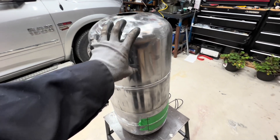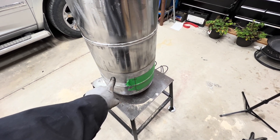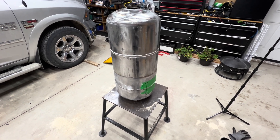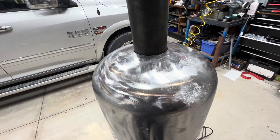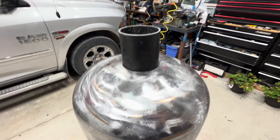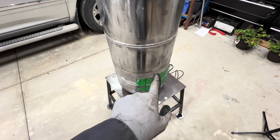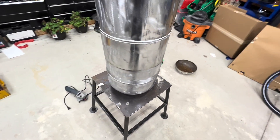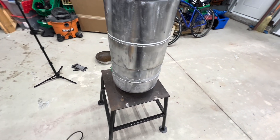With that flue coming out from that hole and welded tightly around there, this other part of the tank is going to sit on top of that 20-pound tank and will be the water heating vessel. The flue running through the domed part of the combustion chamber is really going to act as a miniature water heater — very similar construction to what you'd see in a residential water heater, just scaled down considerably. The flue will stick out the top and be welded watertight on the inside, and where the 30-pound tank meets the 20-pound tank will also have to be welded watertight.